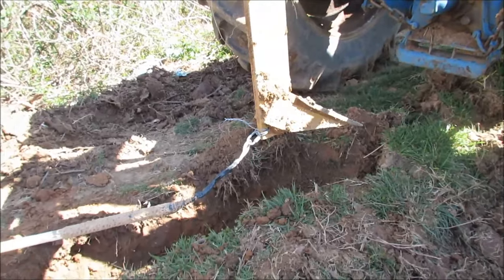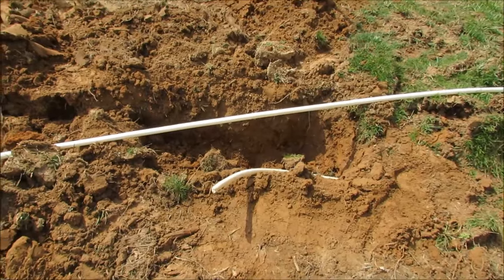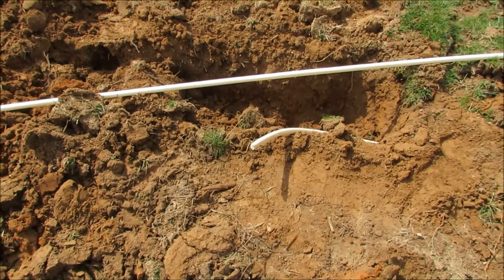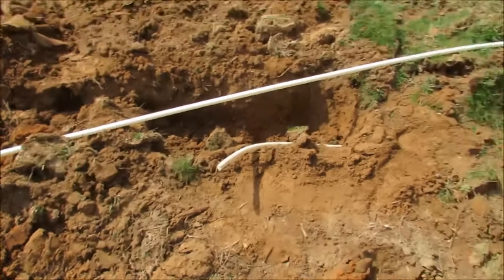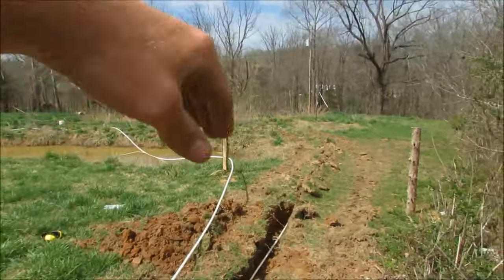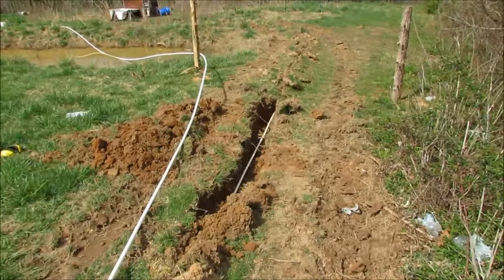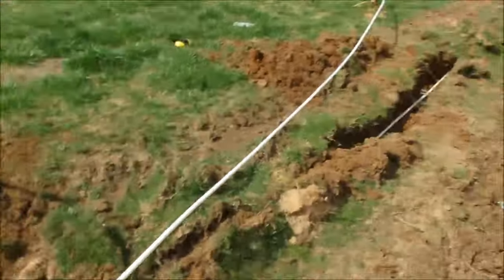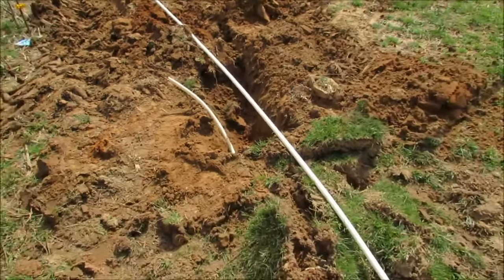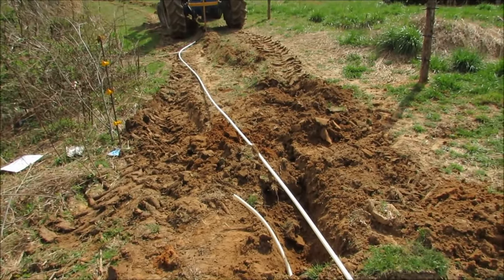My rigged-up Kellum's grip worked just fine, but it ripped the pipe in half. I think the problem is pulling around a big curve that goes all the way over towards the house - that's just putting too much friction into the pull. If it were a straight run I could have done a full continuous pull, but I just don't think that's in the cards.